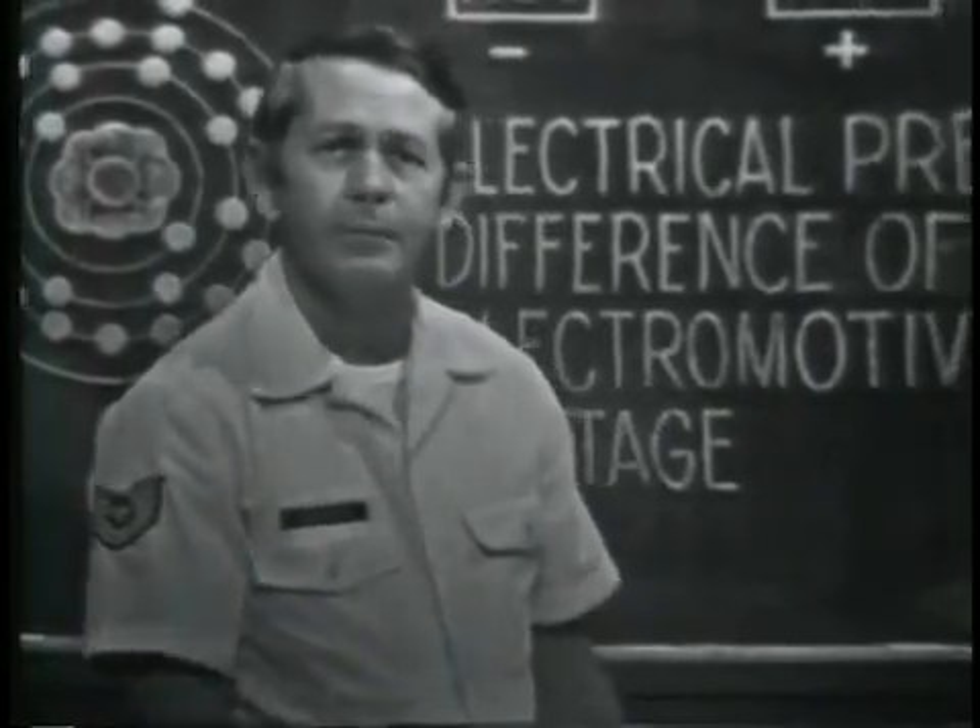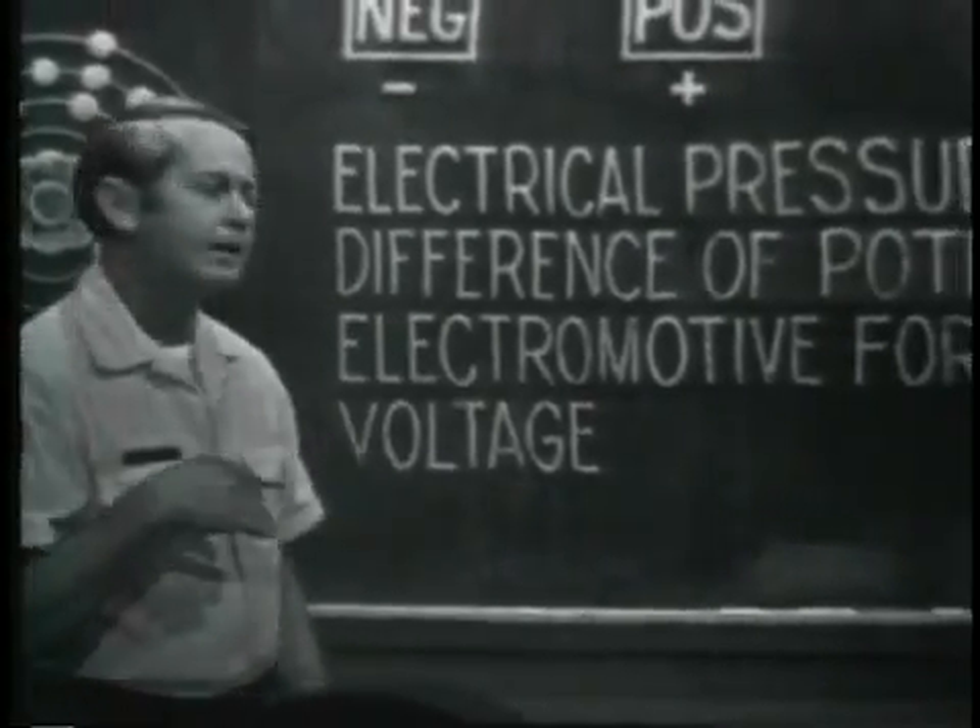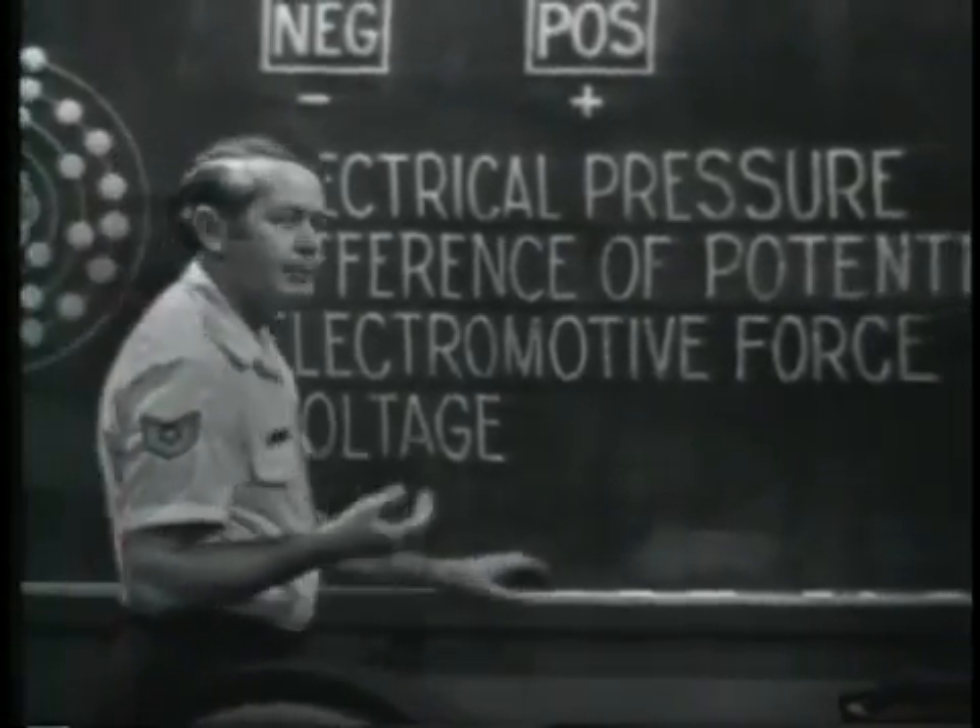We've also found that a battery has two charged materials. If a connection is made between them, electrons will leave the negative charge and travel to the positive charge. Let me make such a connection. And you see the results. Though the pressure is small, it caused enough electrons to flow to burn the wire out. This force is called an electromotive force, or an EMF.